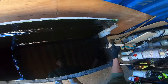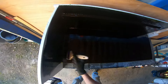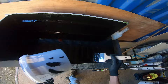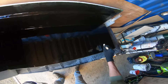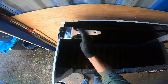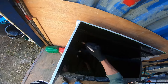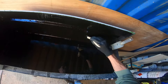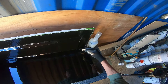Check behind that brush for any brush fibres that might be pulled out into the gel coat - which is another one just there. So because we've disrupted what it looks like and how thick it is, we'll redo that bit there. So we'll lay it off vertically up there. If you sort of go over it - let's say three times - you should get that nice and level, laid off.